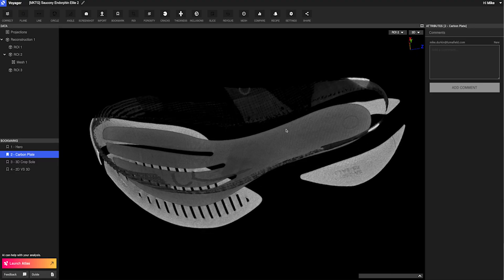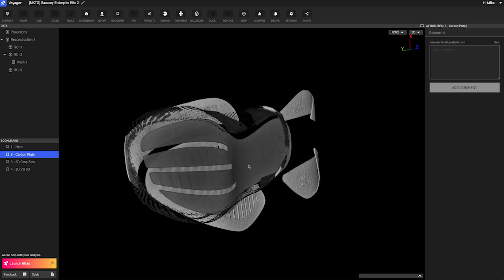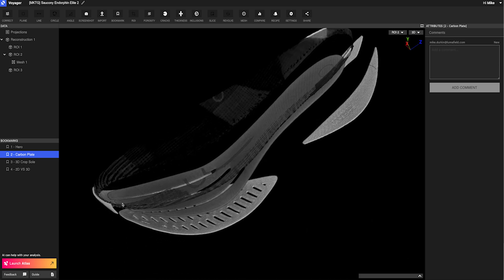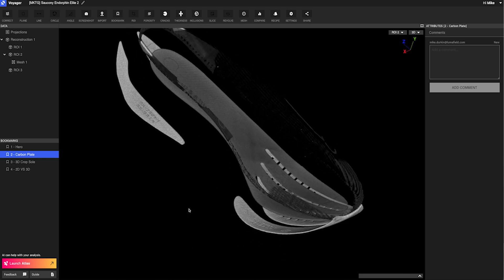Let's talk about the plate geometry — the S-curvature was specifically engineered that way, and we want to make sure we're maintaining dimensional accuracy as the shoe is assembled. Sometimes as shoes come together there's a little variance, so we want to make sure we're catching any issues earlier on in R&D samples. We want to make sure the carbon plate thickness is correct and that the pocket where it's recessed into the foam has enough depth, so as these components come together we're creating the best quality product. This is our flagship shoe and we're not compromising on material quality.